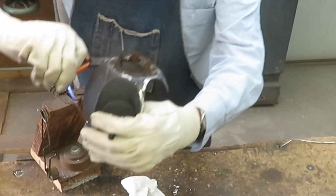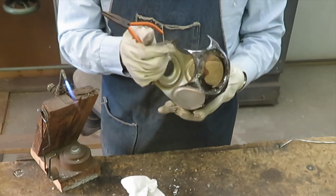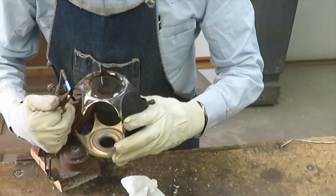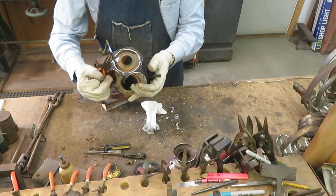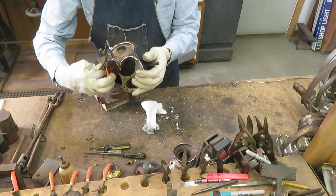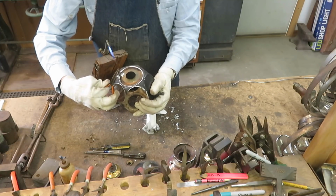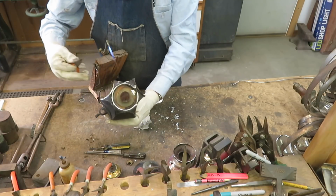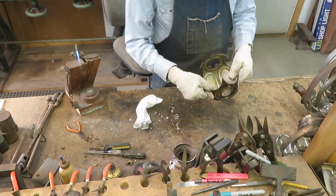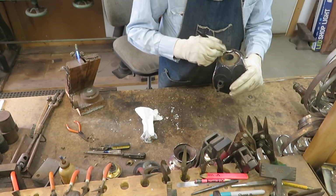At this point, I'm just making sure that those door frames are solidly attached and are not going to move, because this is where I will start on my reassembly of the lamp. The door panels establish the position of all the glass, so I just want to make sure that it's positioned correctly. I'll number each piece of glass and make a diagram denoting where on the lamp it was originally located.